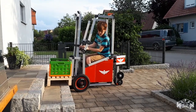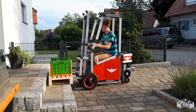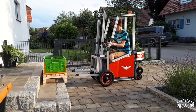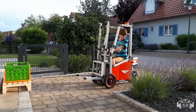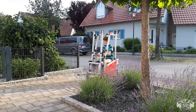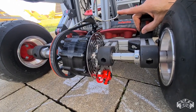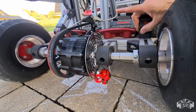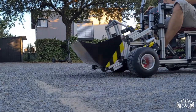Although the ride is quite slow, I learned from the forklift project that having a disc brake installed makes perfect sense — not only for stopping, but also to prevent the ride from rolling away on sloping ground. For the actuation of the brake I used the handbrake lever installed in the footrest area as a brake pedal, so the driver's hand could stay at the joysticks at all times.